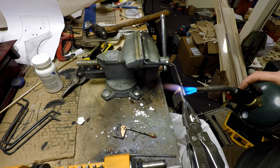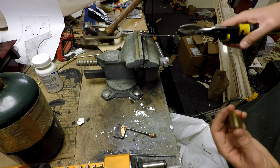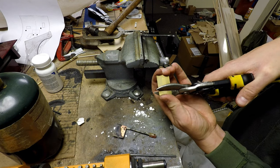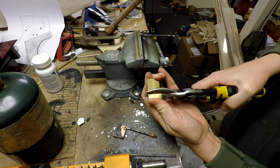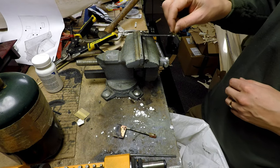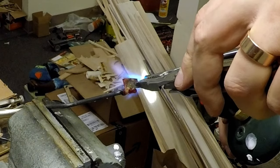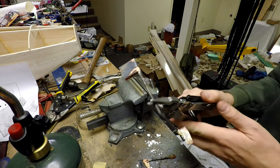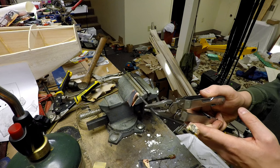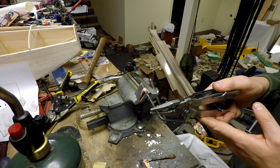Just like before, I brazed inside the brass, then reheated to put them together. On the top of the upper support arm, I need to make the attach point for the push rod from the servo — that's simply done by brazing a piece of brass right on there. Keep in mind that when you make the other side, they need to be mirror images of each other — you're making a left and a right. All other parts can be made identical and just flipped around as needed.